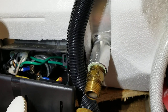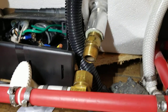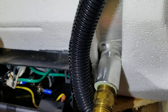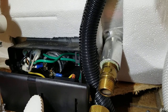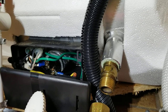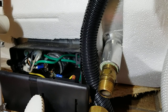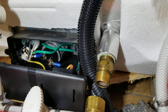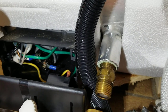The problem is when I disconnected the bottom valve for the bypass, about a half a gallon of water came out that I had to suck up with the shop vac before it got all over the floor. That drain is considerably higher on the tank than where the heating element goes in. I suspect this is one of the smartest, dumbest ideas — it probably helps more people than it hurts, because the number one reason heating elements go out in RVs is people flip on the electric element before filling the hot water heater. In this case, there's going to be quite a bit of water in the bottom that never drains out, so if I pull that element, I'll have a half gallon to a gallon of water pouring into that box all over my RV floor in a tight spot.